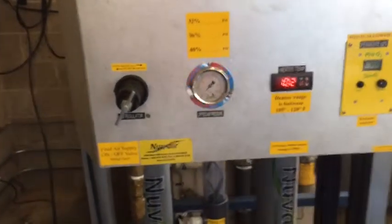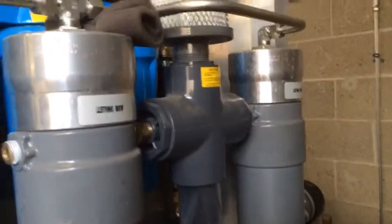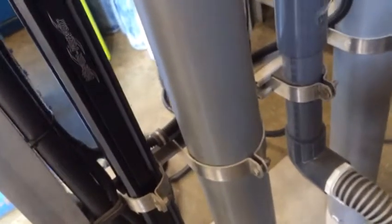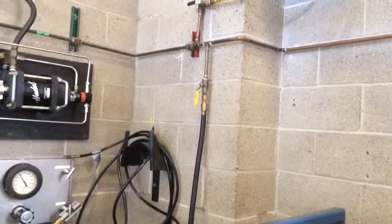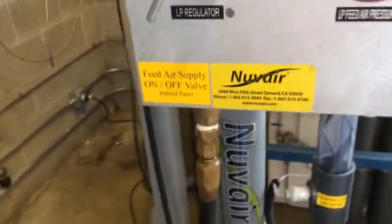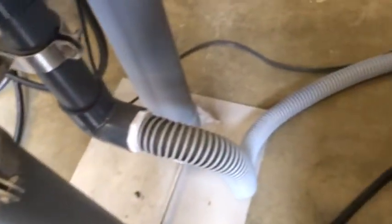We're going to have Mike here give us a hand as our lab tech assistant with this system. Basically, we have membranes that actually trap particles of nitrogen, while oxygen flows through the membranes faster. The resulting content of air is going to be enriched air nitrox — higher than 21%. We are taking regular filtered grade E quality air from the building, supplying it to this panel, which feeds into the membranes. The membranes then discharge into a mixing chamber right in here, and then feed down through an intake hose that goes right into our low pressure compressor.